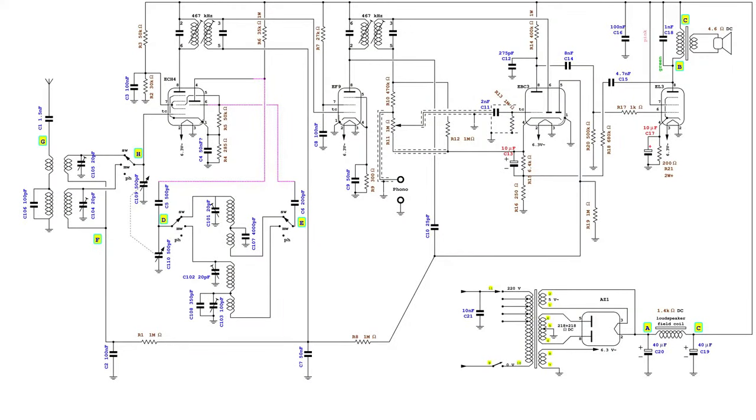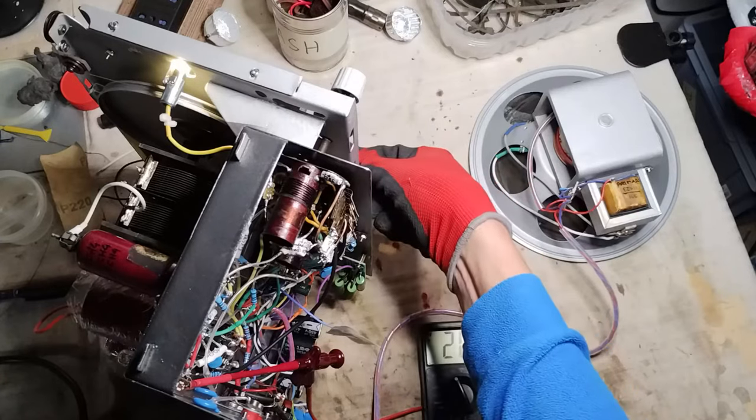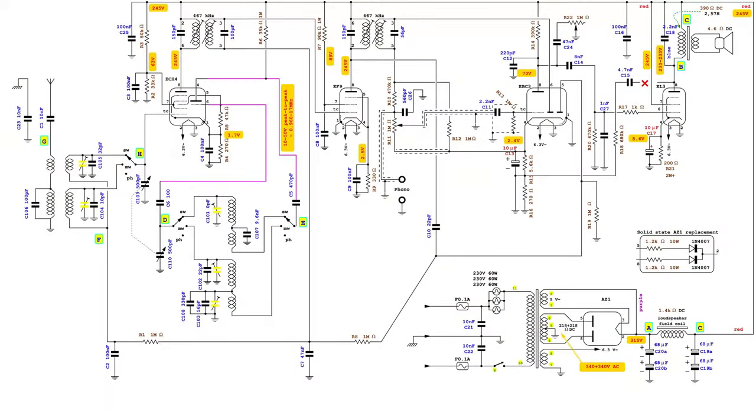This is the original schematic diagram, obtained by reverse engineering the circuit of the radio, including the RF module. Initially, except for some safety changes, that was reproduced as close as possible to the original. However, there was an internal oscillation in the audio preamplifier section. Therefore, the radio was modified, adding a capacitor to stop the oscillation, and also removing the feedback between the final amplifier tube and the preamplifier.